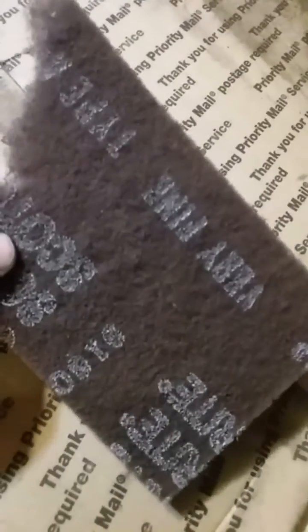Get a piece of copper clad and rub it on a Scotch-Brite pad — this is a very fine grade but you can use the green ones, a regular kitchen sponge, or even some finer sandpaper. Just get all the corrosion off and rough it up a little bit. That gives you a better surface to stick to for both the lacquer we're going to use and your toner.